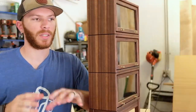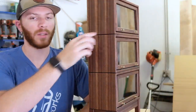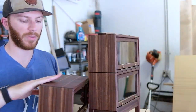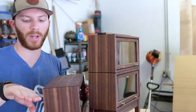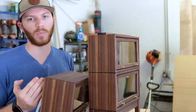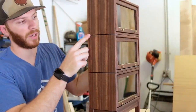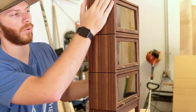When I first started designing this box, there was one design element I really wanted to incorporate: a continuous grain pattern on the sides of these boxes. There were two things I had to do to make that work successfully, one of which was the joinery. Traditionally, the top and bottom of a box are longer than the sides, so you'd have end grain showing at the sides. I went the other way and have the side panels' end grain exposed at the top and bottom, which prevents any end grain from disrupting the continuous grain pattern — so it looks like one board going up the side of these boxes.